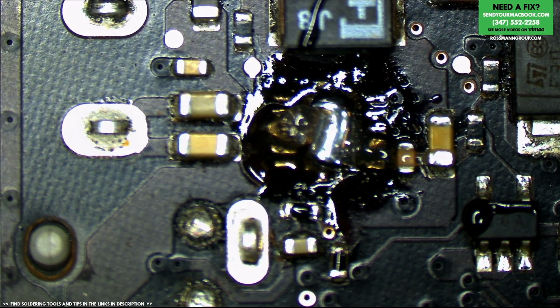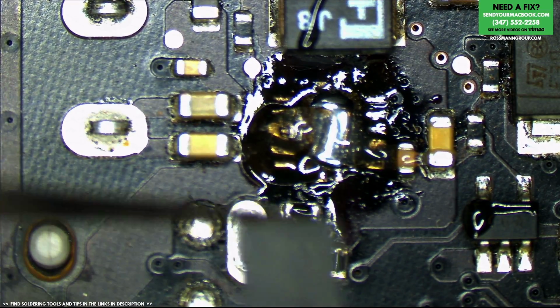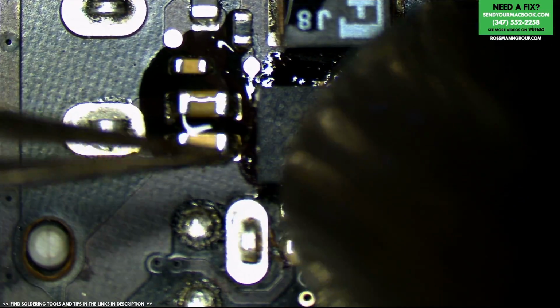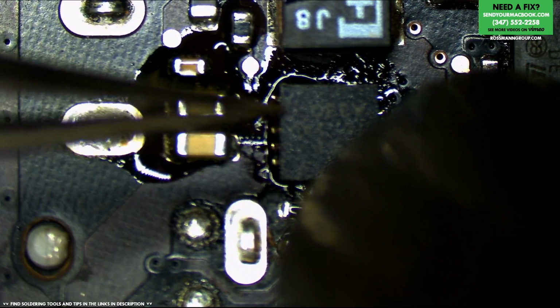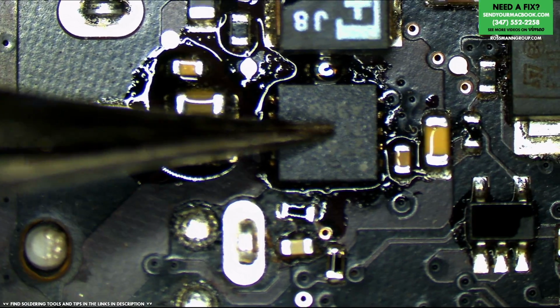You know, if I work by the ISL at that point, I'll usually take the RAM out at least, because the weight of the RAM will pull the RAM slot a little if you're heating it. But this is far enough away from the RAM slot that I don't have to care. Just barely by enough. And I'll use low airflow. You'll see, this will slip right into place.